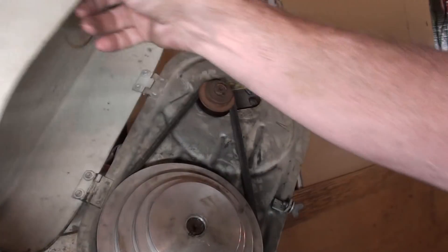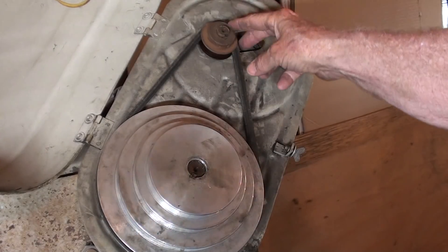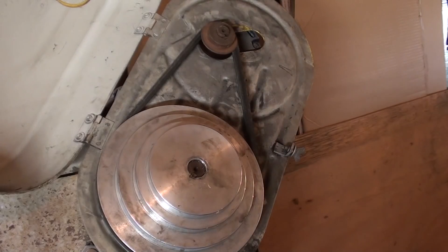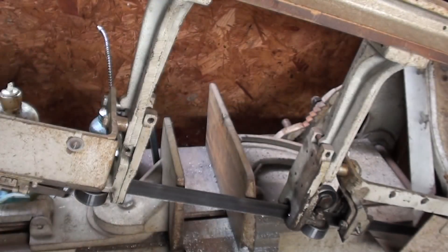I've had this saw since '98, so I guess I've had it about 20 years. What I noticed when I went to change it: there's a big step pulley here, and just a small one — looks like about a 2-inch pulley — so that really slowed it down, and I don't know why there is no step pulley. I'm just deducing that there was an ornery foreman at Jostens where I got this who was sick and tired of replacing blades, and set it at slow speed on purpose. I made that up — that's what I would do in a school shop. You can see how slowly that blade is running; it's right at about 40 feet per minute, which is really too slow even for steel.